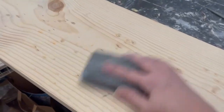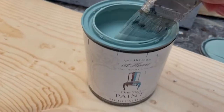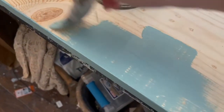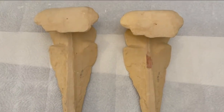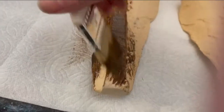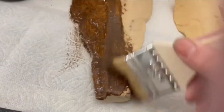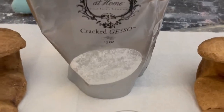For the shelf I got a 4-foot by 12-inch by half-inch common board at Home Depot, sanded it down nice and smooth, and applied two coats of the green-blue paint color. I then found these great corbels at Amy Howard At Home. To create a shabby chic chippy look, I first stained them with her gel stain, which creates a beautiful wood look underneath that's going to poke through. Cover with the gel stain and let it dry for about an hour.